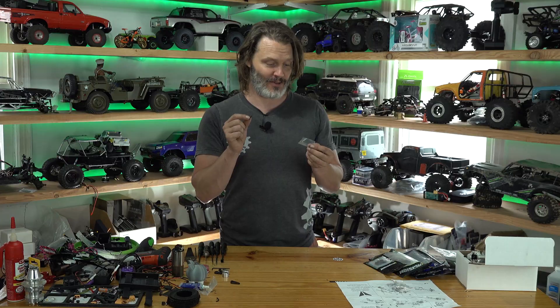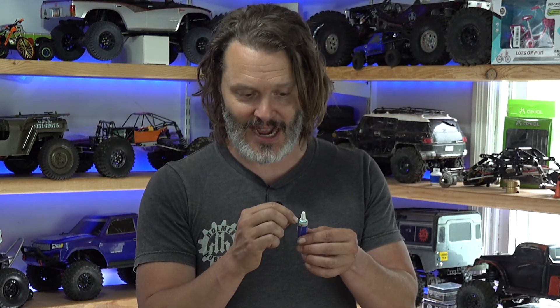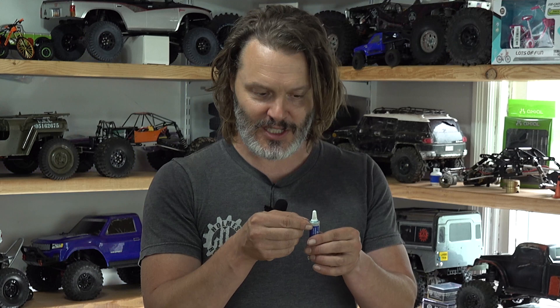More experiments might need to be done, but so far it's looking like not only is Loctite anaerobic — meaning it doesn't need oxygen — but it also needs those ions from a metal to cure. What type is this? Technically, this is Prime Lock Type 245 Blue Threadlock Formula. And you can see the stuff on the outside that's just been sitting there — it's liquidy and gooey, and that stuff is super old at this point.